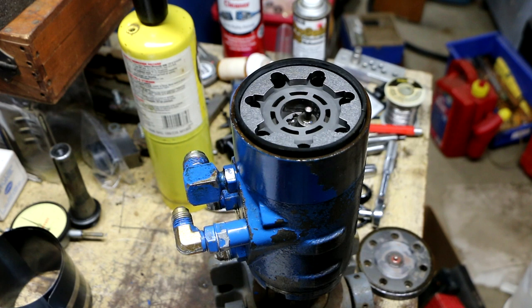Now, when I first read this next paragraph in the instructions, I have to admit I was kind of flummoxed. It took me a few minutes to figure it out, but now I have a grasp on it. Let me just read it to you the way that it's printed. To allow for washer 37, assemble commutator 34 with counterbore up into commutator ring 33 with slotted hole in commutator engaging nose of drive link 30. Align commutator outside diameter concentric with inside diameter of commutator ring.